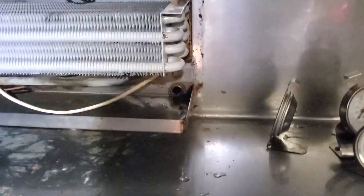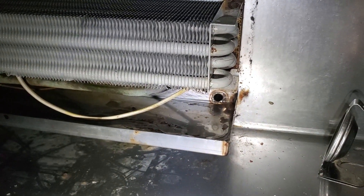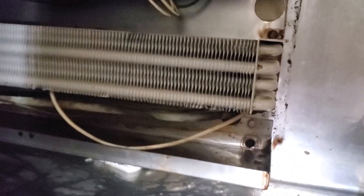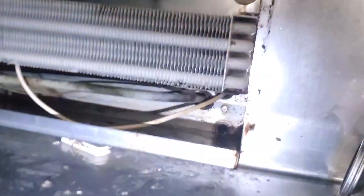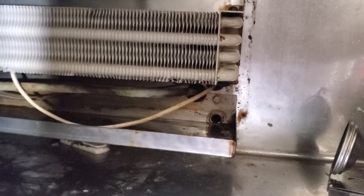Do you see now? Everything is totally clear. I actually vacuumed this — that's actually syrup. If you look here at the top, they have a lot of fruits and stuff that they use to make food, and it's right over the top of the fan where the evaporator's at. What happens when they get stuff in here because they're working so fast trying to keep up, the syrup and stuff from old food falls down through the vents of the fan. That's the evaporator coil. And then it collects down here in the actual drain tray and blocks that tray. So this is something you're going to be doing in restaurants quite a bit — they always have backed-up drains.